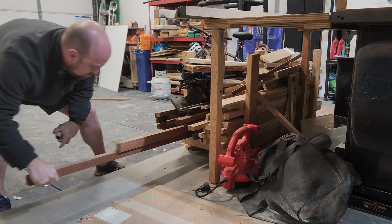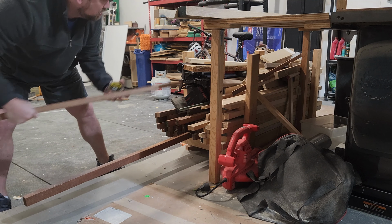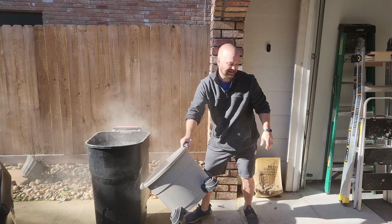Making a cutting board is a relatively easy and straightforward process that I would encourage any hobbyist woodworker to try. Variations of cutting boards are really limited only to your imagination. In my case, I'm using primarily oak and walnut to create a stepped look that's going to include epoxy on both ends. I'm also choosing to make a long grain, also known as an edge grain cutting board, to mirror the style that I'm going to be using for my desk.